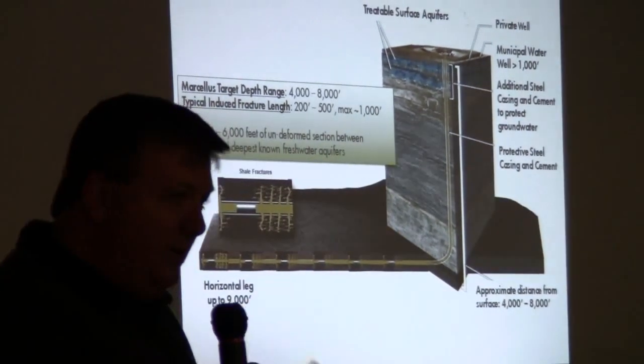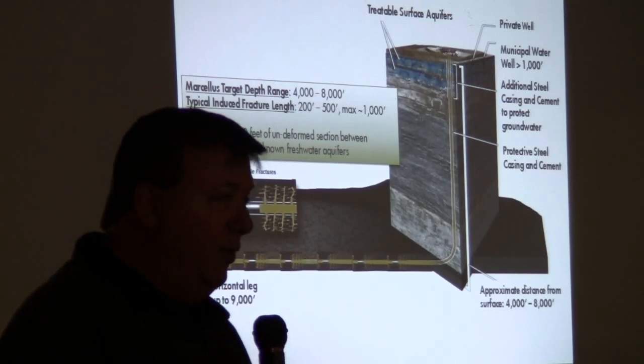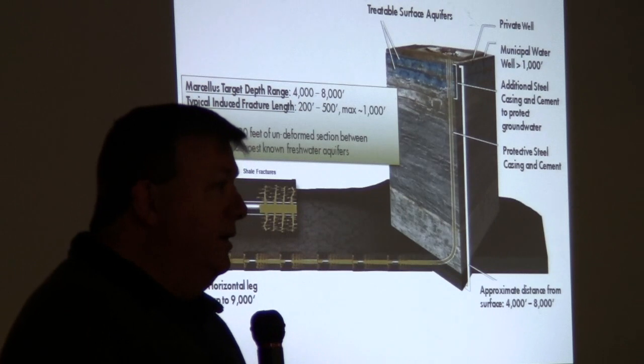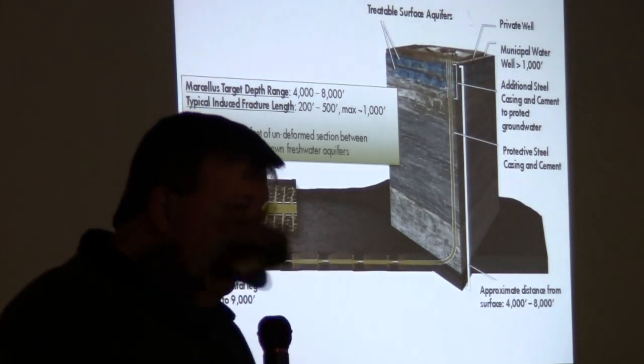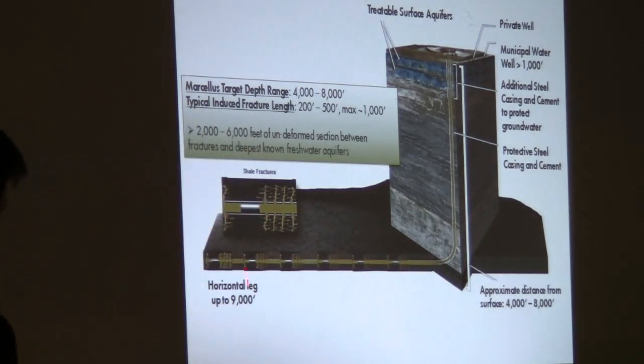Okay, so the production comes up that production casing, or in many cases, and moving forward, it's going to be more up the production tubing. So there will be another barrier of sorts with the production tubing between the borehole and the lateral aspects of the subsurface. So once we've got the production casing set, we come in here and we perforate this first zone. And we fracture stimulate that, and I'll go into that in a little bit more detail in a minute.